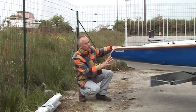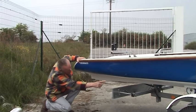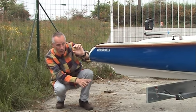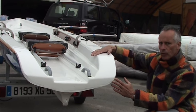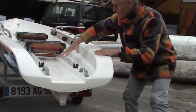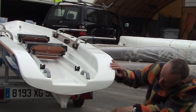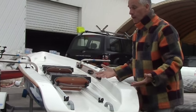The yole is suitable for use on the sea and is self-bailing — water that comes in goes straight back out. The waterline comes right to the tip of the boat with a gap between the waterline and the open aft. The yole is made of two hulls really, an inner hull and an outer hull — this is how lifeboats are made — with a lot of air trapped inside. That's what keeps it afloat and makes it feel like a cork on a rough sea, riding over waves easily. Any water that gets over the bows just runs straight out of the boat.